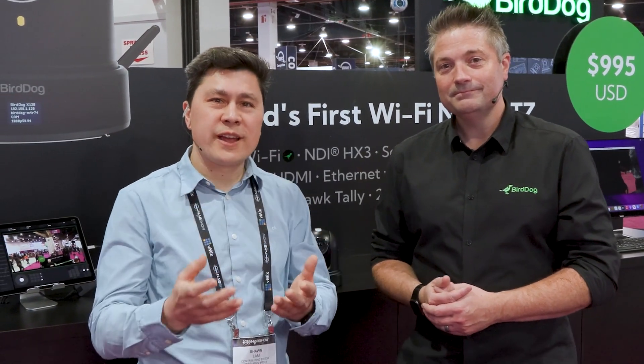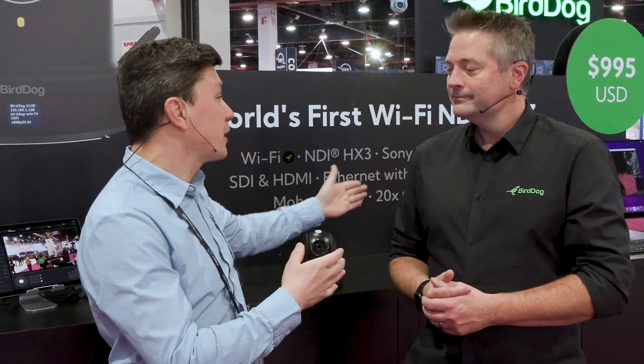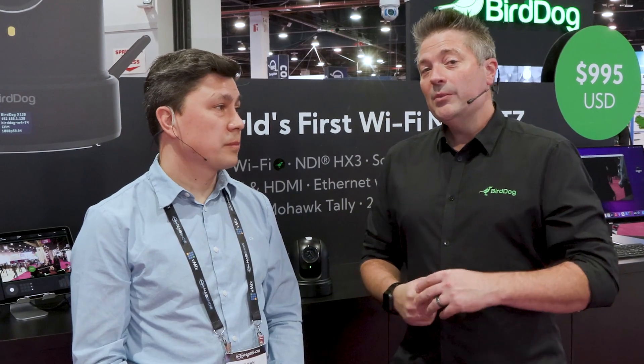Let's talk a little bit about the flavors of NDI — a bit of an overview, and then which version are you utilizing here? BirdDog were the first people to put NDI into a piece of hardware, and we've been really famous for using what we call full or high bandwidth NDI, which gives you the ultimate picture quality and really low latency. This camera here, we've actually introduced a BirdDog version of NDI-HX3, which really keeps that latency down as low as possible. NDI-HX is a format that's been around for a little while and is used in a lot of other PTZ cameras — it allows a lower bandwidth, more high-efficiency compression. In the BirdDog implementation, we're seeing exceptionally high quality pictures from our sensors processed into that NDI-HX3, and what we're seeing in terms of overall workflow and latency is really very impressive.